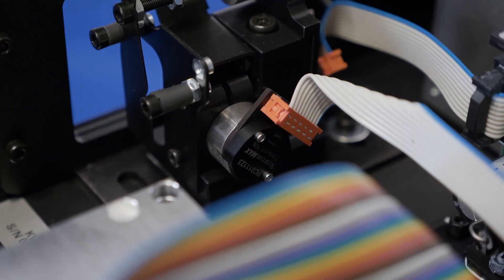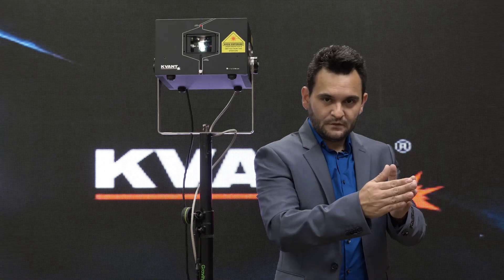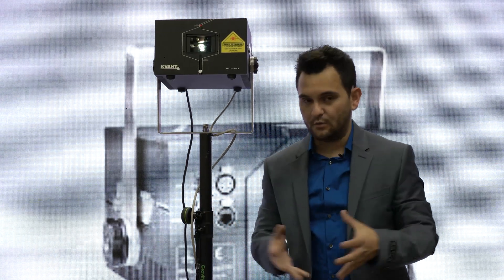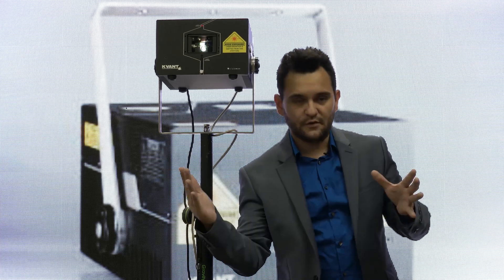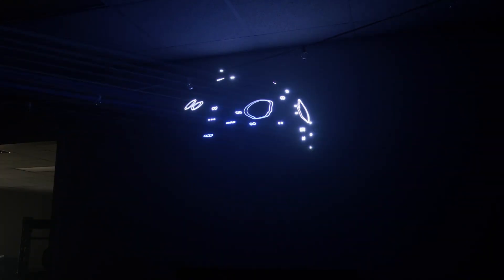The Kvant ClubMax features the Compact 506 galvos — these are the holy grail of galvos within this price range. You get really tight, clean graphics. With lasers, the further you spread the beam apart, the faster those galvos have to move from point A to point B, and the wider you move it the longer that travel distance is, so you get a little blanking in the image. Because of how good the Compact 506 galvos are, you don't get as much blanking or distortion. They can also travel a further distance within the galvo itself, meaning with this laser I can achieve a beam width that would take two other lasers to do. The Kvant may be a little more expensive than your DJ laser, but when you consider it takes two regular DJ lasers to make the image this one can, it pretty much pays for itself right off the bat — not to mention you also have the FB4 and all that included.